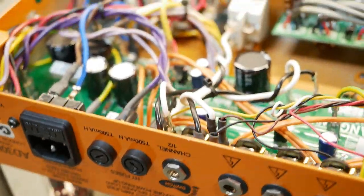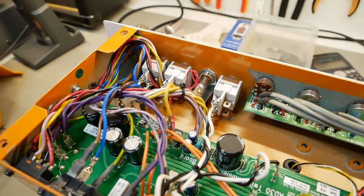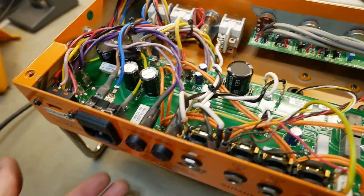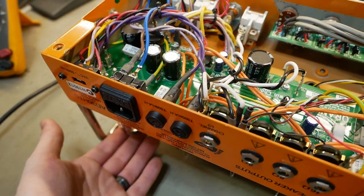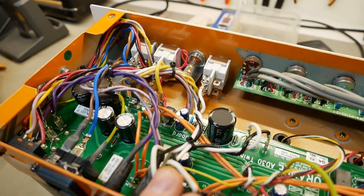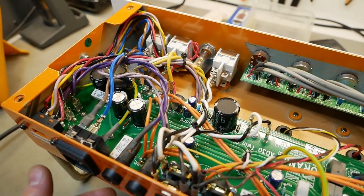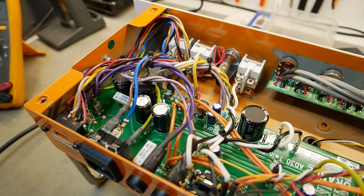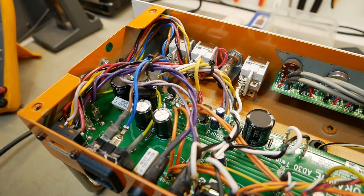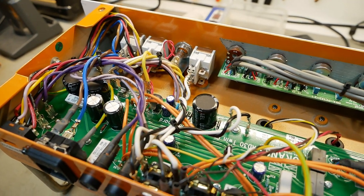Now this is one of those amplifiers where you don't want to use a standby switch, because when the valves are heated and that rectifier is ready to conduct, you flick that standby switch, all the capacitance is post standby switch, because it only switches on and off the center tap of the transformer. So the rectifier valve gets hit with a big surge of current from these caps charging up. And over time, it only puts up with that inrush so many times, and then it gives up the ghost,